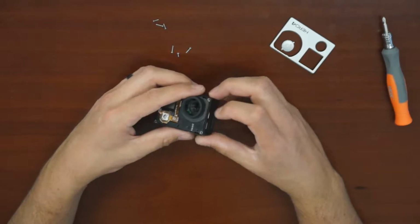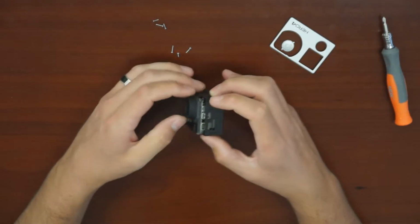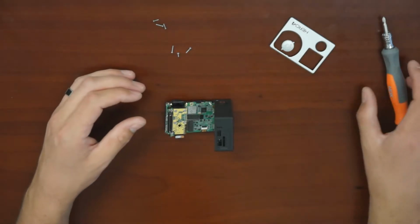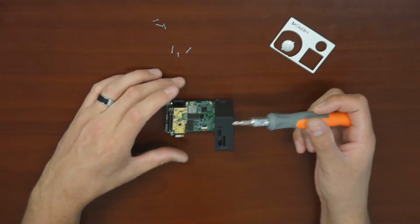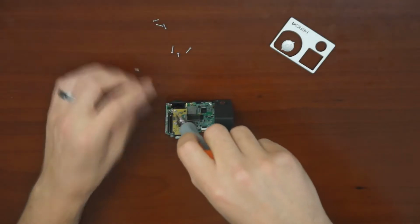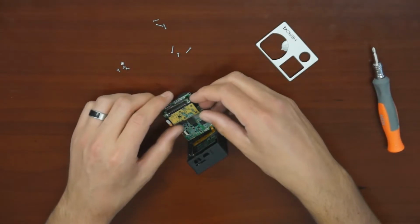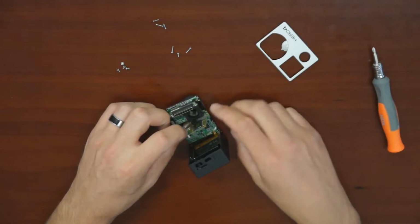after you've undone the screws, pull this apart, grab the lens surround, carefully scissor it open. Now this is about all you need to take apart, except for the 4 screws to hold the sensor on. You don't need to do anything else. Once you have the 4 screws undone, holding the sensor on the SuperMount, flip the sensor over.